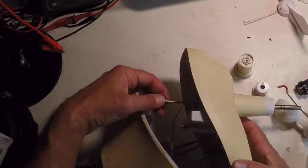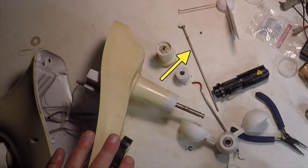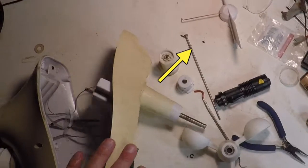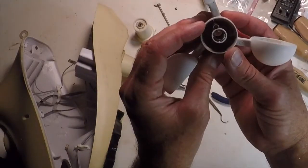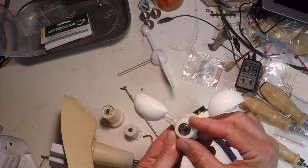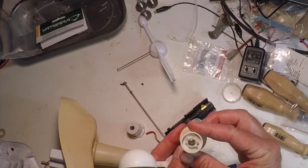Here I'm removing this little shaft that goes inside that stalk - I just pull that out so that I could grease it and check it for burrs and that sort of thing. Here we finally got into the bearings. There's one on the bottom of the wind cups and there's one on the top, and then there's also one embedded in this piece right here.